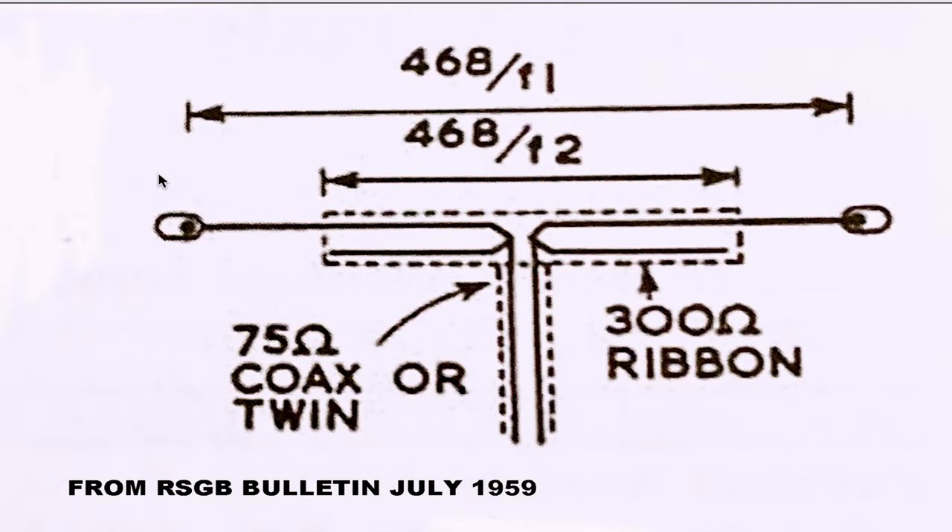On the screen you can see the basic antenna. The overall length is going to be adjusted so it's resonant on the 40 metre band. We've got the formula above it which takes into account the velocity factor of the 300 ohm ribbon. Because we have an overall length resonant on 40 metres, we have a section of 300 ohm ribbon inserted, and that section will be resonant on 20 metres. So what you've actually got is two parallel dipoles — the 40 metre dipole is the overall length, and the bottom section of the ribbon feeder forms the 20 metre section, approximately just over 5 metres long as each side is a quarter wave on 20 metres.